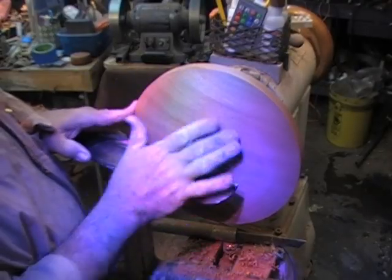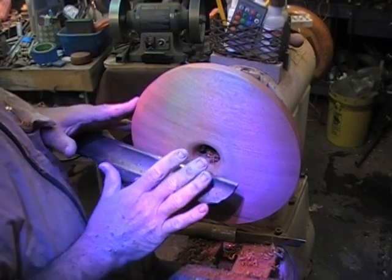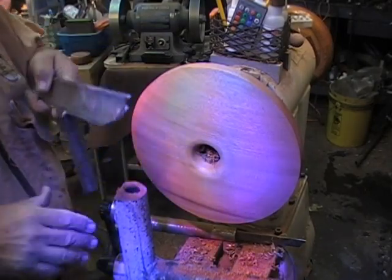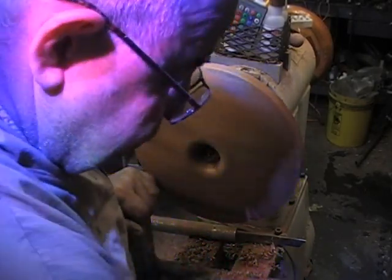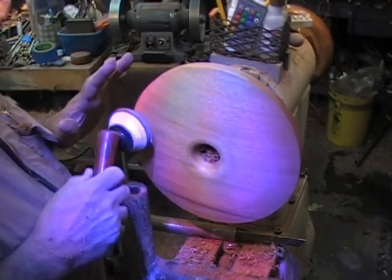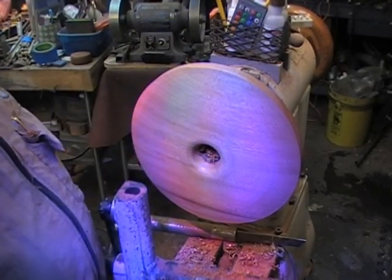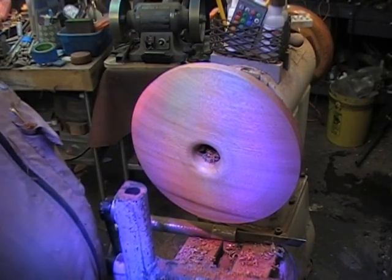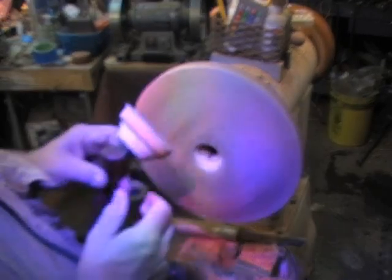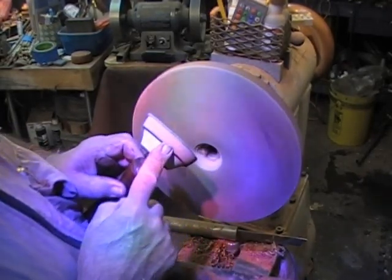Essentially, we have completed this side basic. All right, now we want to sand this out. Want to start with 180 grit paper, and we're going to do it with our self-powered sanding rig. And want to sand this 180 all the way through 400. Now, time passes. Now, you might notice when I'm using the pad, I've got an interface pad between them.